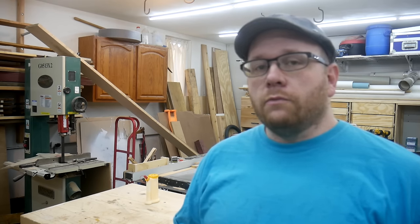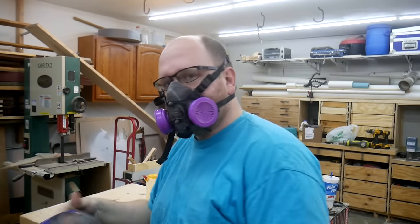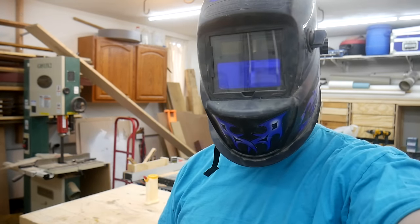Now it's time to prepare to do some welding. I can see the comments now with all the warnings about welding on Unistrut and other galvanized hardware. Zinc poisoning is a very real thing and it's serious, so before you do anything you need to take some precautions. If you can't prepare the metal to remove the zinc coating, there are some things you can do. First off, obviously you're going to be wearing your welding helmet, but under your helmet you can wear a respirator to help filter out some of those fumes. Also, increasing the air circulation in your shop and venting the air to the outside — which I am doing here with this squirrel cage fan — will greatly reduce your chances of getting sick from the zinc fumes when welding on zinc-plated or galvanized hardware.